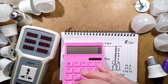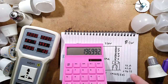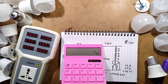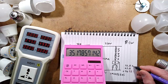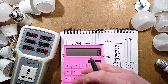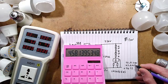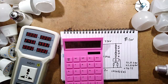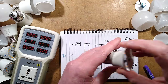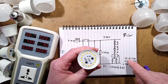At 8.1 watts, multiplying by 24.32 gives approximately 197. So 197 divided by 56 ohms gives 3.5 watts, and 197 divided by 43 ohms gives 4.6 watts. By cutting one of those resistors out, I can take it from 8.1 watts down to either 3.5 or 4.6 watts. For good longevity and maximum efficiency, I'll remove the 43 ohm - the lower value which results in higher current - and just leave the 56 ohm.